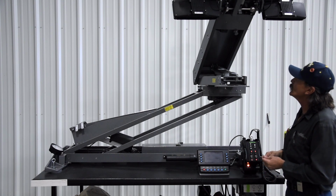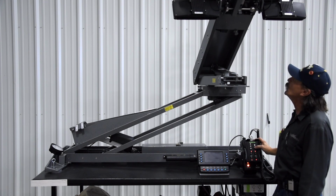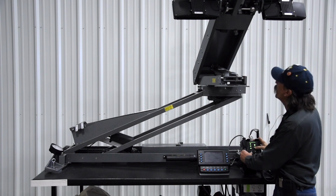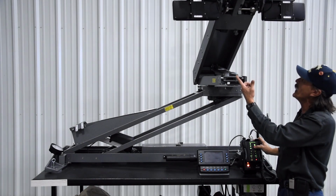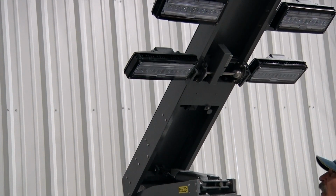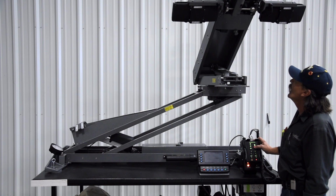The various sensors, backlight has two Omron switches on it. Basically what those will do as the tower is activated, the backlight switch is pressed, they will oscillate between the two switches. Once they make contact, it flips a relay, reverses in polarity to the motor, and then it will just reverse the direction that the lamps are rotating at.